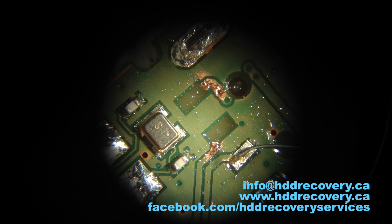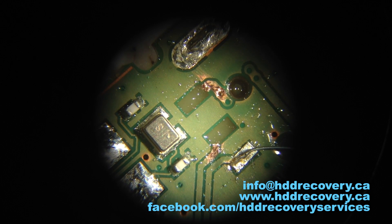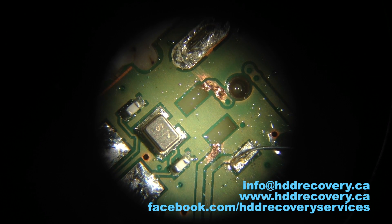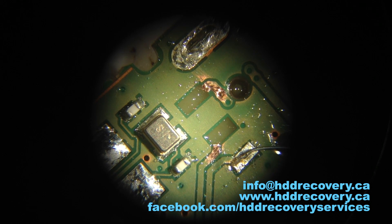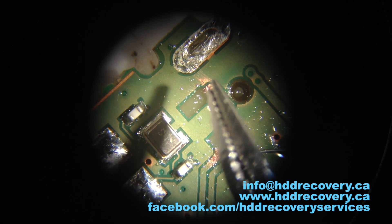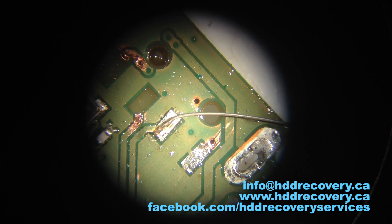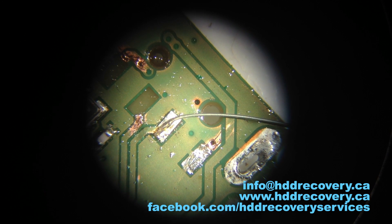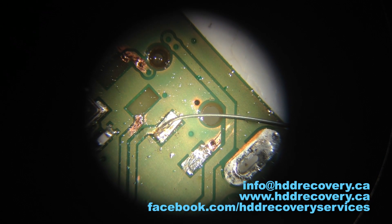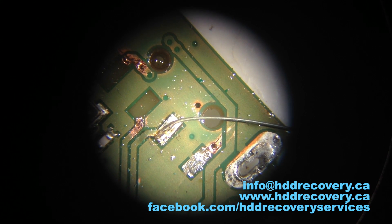So we remove them completely, cleaned up the parts that were attached to them, and now we're going to solder individual pieces of wire directly to the positions where those pads were supposed to lead. In our case it's going to be this little piece right here and this little piece right there. For the ground, we're going to use this via hole — stick a wire right in there and solder it in. Then we just need to reconnect those pieces of wire to the proper prongs on the connector, and that should do it.